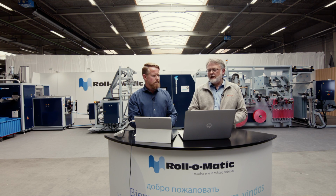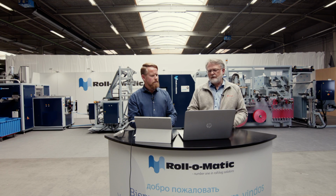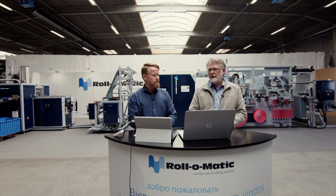Where if you have a sealing drum, which we also have in our program, so we know sealing drums very well. We use them for very thin gauges where they are doing fine, but if we're talking about medium and heavy gauge, there's not enough sealing capacity in the drum systems, and therefore we use the Delta machine for this. Then, of course, there's other things as well, but as we already mentioned, the hem seal system, where we have a very high quality sealing with the sealing wire is a good advantage.